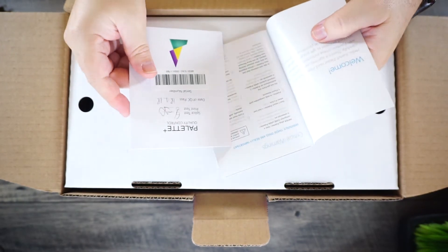Not just PLA, which is basically like a plastic — you can print in PETG, PLA+, PETG+, and even water-soluble filaments. What water-soluble does is when you build your 3D model it creates a scaffolding type effect on the inside. Once you get the thing printed you take it out, put it in water, and it dissolves the scaffolding. Depending on what you printed it could take a little while, but it just dissolves. To me that is insane — it hits me on every nerdy level.